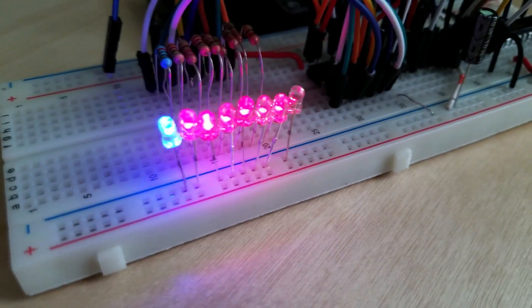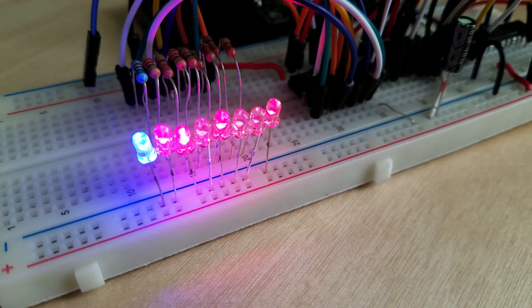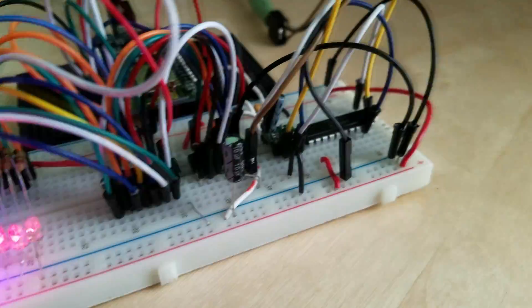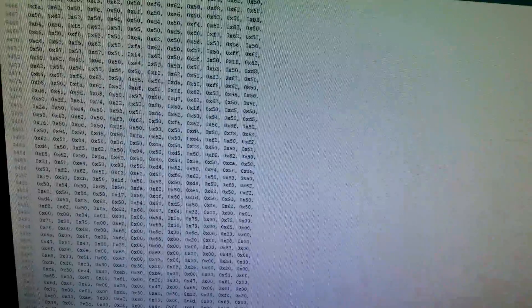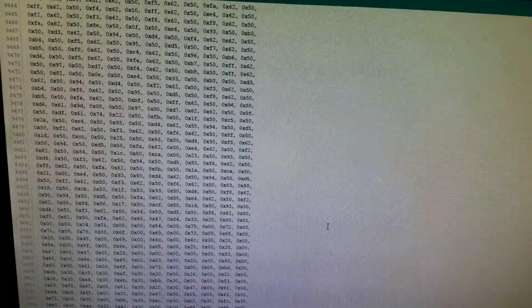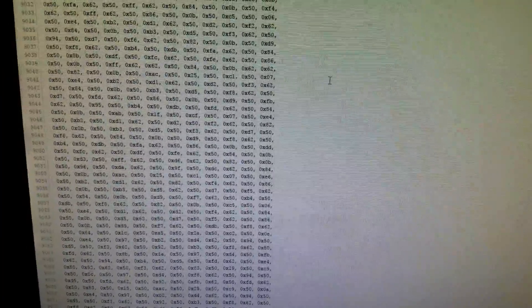You can see right here — those flashing LEDs are showing the bytes transferring from the shift register over to the PSG chip. If I look up here, you can actually see the data for the song that's playing right now. It's just an array of 8-bit constants.